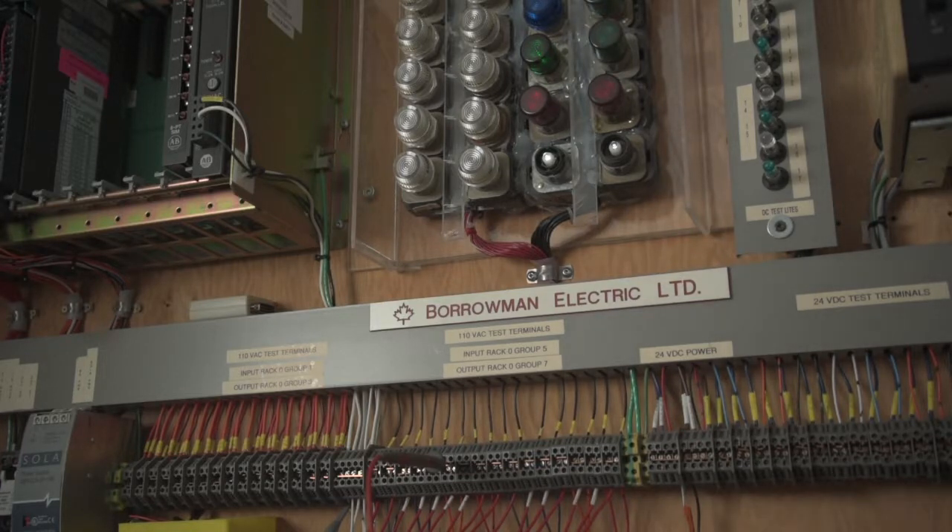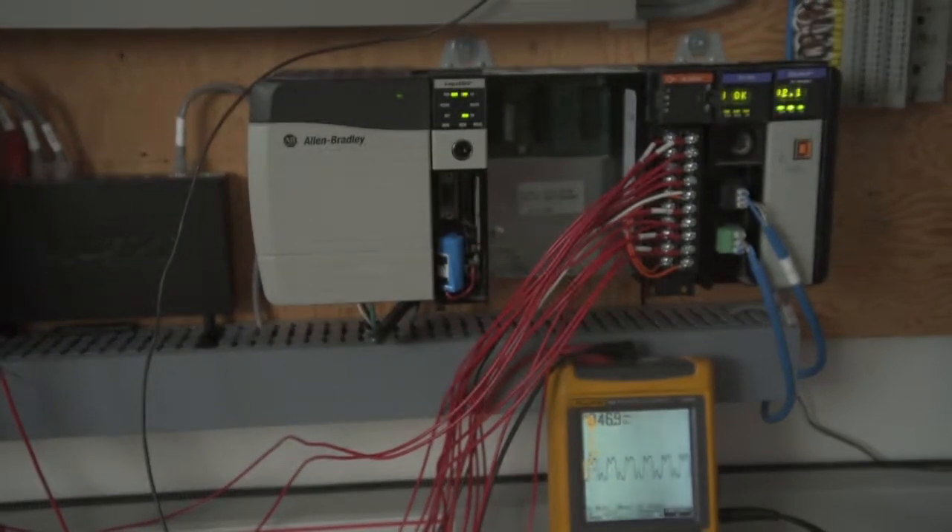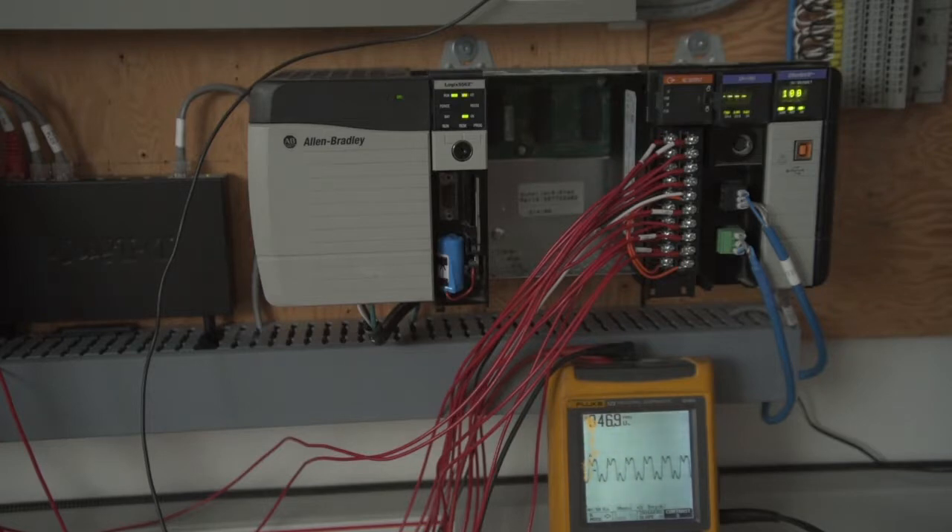So there's no consistency to this. Allen Bradley used cheap components in their cards. To fix this, you would have to get better quality TRIACs and change them all out on every card. With 16 TRIACs per card, if you've got 10 or 12 cards, that's 160 TRIACs — you'd be dazed at that. So be careful when buying version 2.3 cards; stick, if you can, to the newer version 3.2 cards. Thanks a lot, hopefully this is helpful and explains problems you're running into. Subscribe and come back anytime.